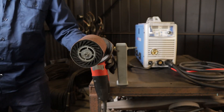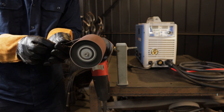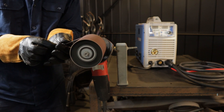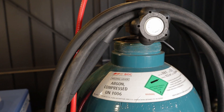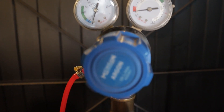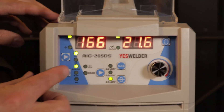If you're new to TIG and aren't sure of the right tungsten to buy, I recommend these. You can weld DC and AC with them, and the 3/32nd or 2.4 millimeter size can handle low amperage. I have the gas flow rate at 20 cubic feet an hour or 9.5 liters per minute.